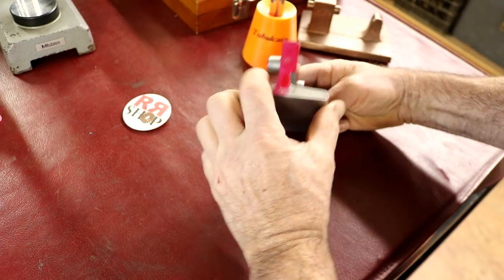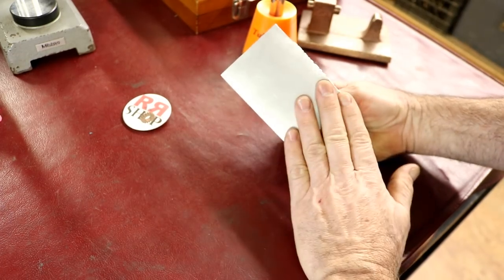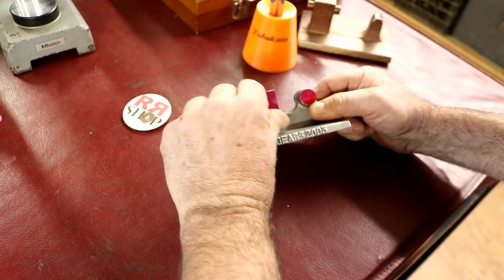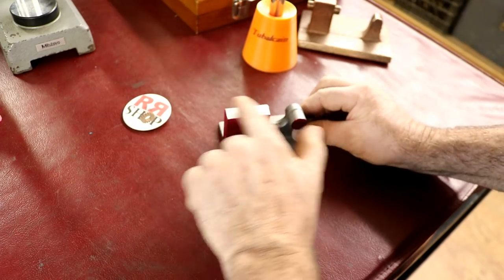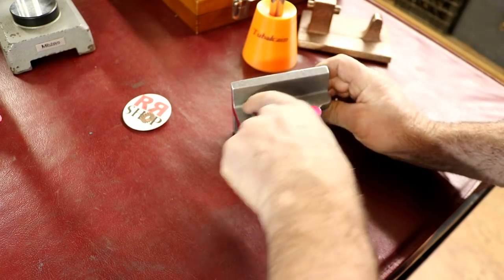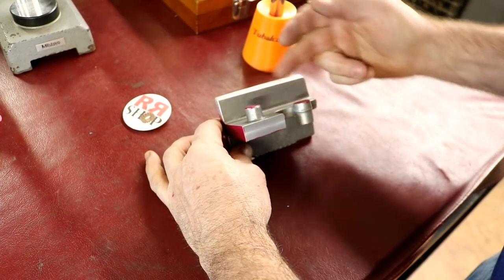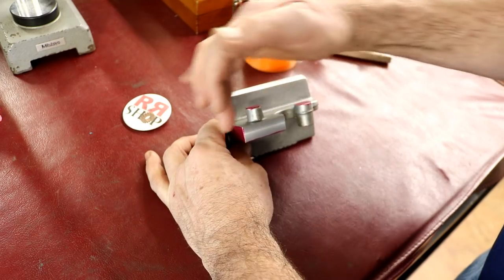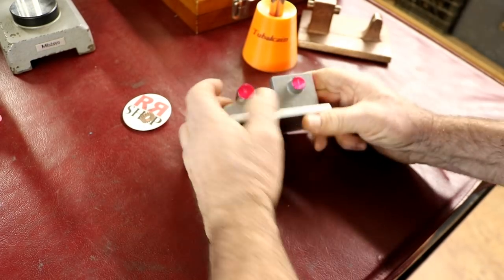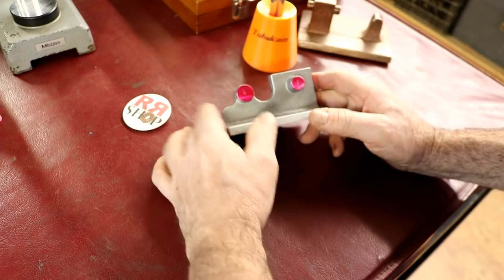So what I did is I decided I'd machine the whole end off of this to square it up. I machined the base, and then this surface here where the cylinder rides, the top. This is a reference surface, the top. I made the end a reference surface, and then this side is a reference surface. That's how I machined it, mainly using this side as a reference, and then the base to this. And I marked out and figured out exactly where the centers of these bosses were.